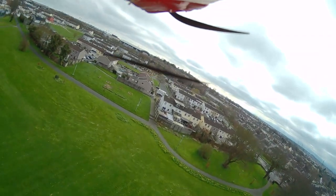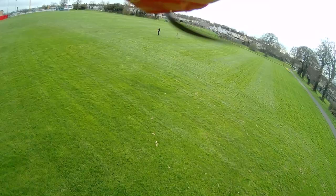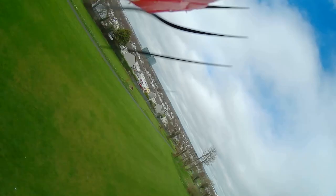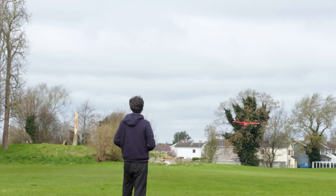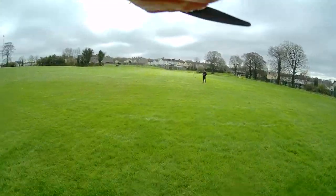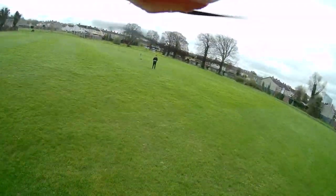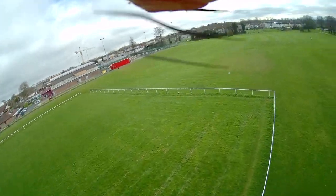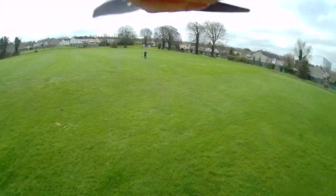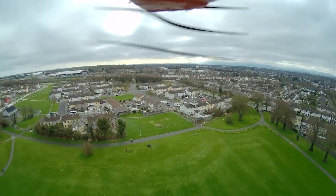After that I tested the other stabilized modes, which are easier to fly, but because I haven't perfectly tuned the software for this aircraft I get some wiggles depending on speed and other factors. This is a very basic setup — we can do a lot more, like plugging in GPS, using FPV equipment with on-screen display and telemetry data in goggles. This flight controller also has a barometer so it can measure altitude. In heading hold mode it shakes a little because it overshoots, so I need to tune the PID settings. If I had wired my FPV system I could change parameters from the radio, but I had to do it on the computer.